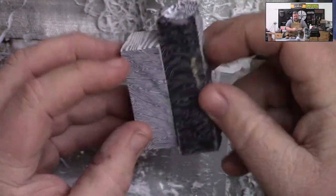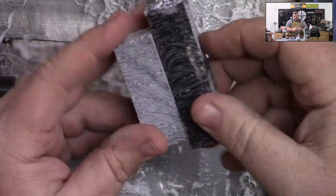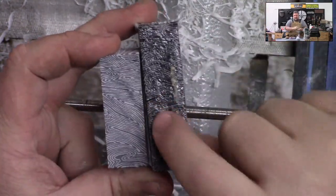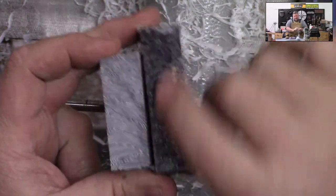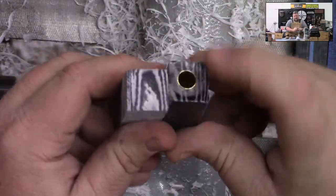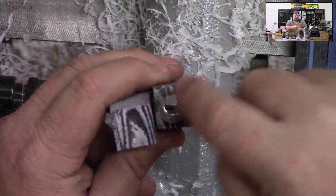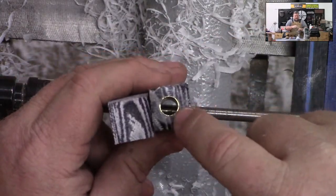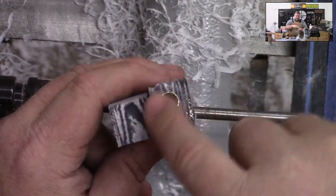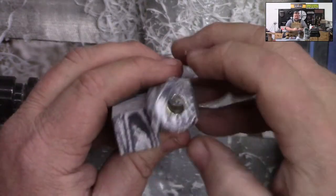Imagine end grain versus side grain. I like to do the end grain, so to speak, so it soaks through the blank and down in there. So this is my CA covered, CA filled blank, and then I've got my tube in there. Now I CA the end before I drilled it, and I CA the end after I tubed it with the glue, and that's just a little extra assurance.